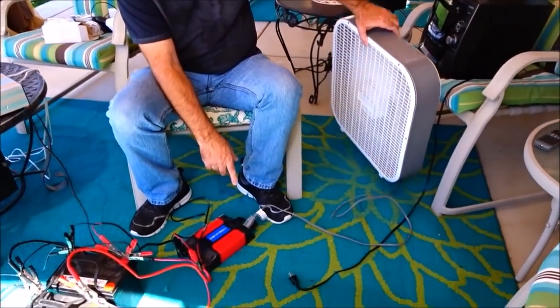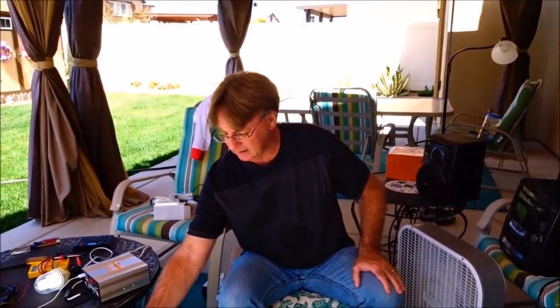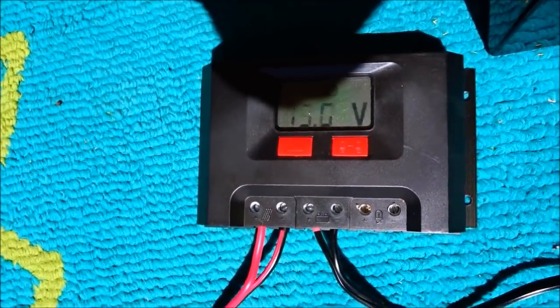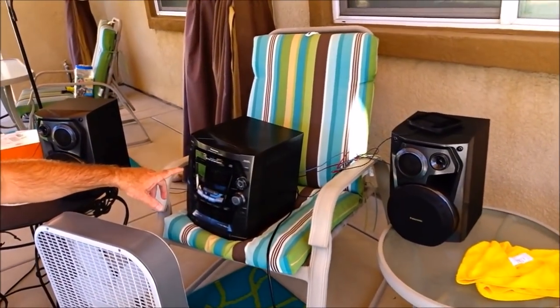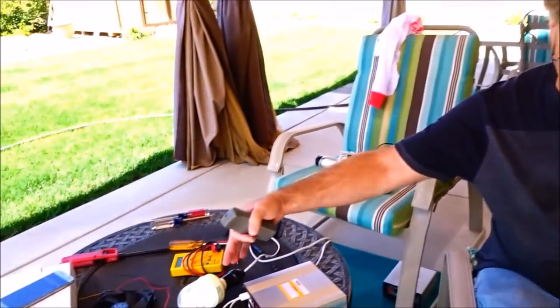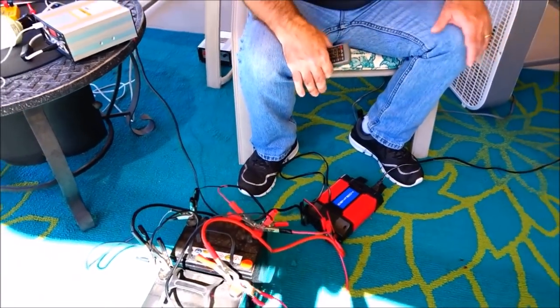Right now I've plugged a regular household fan into the inverter. With the solar on, we're still reading 13 volts, so I wouldn't worry about anything until I saw that voltage come down to about 12.3 — which probably would never happen during the day. Finally in this discussion, I'm going to run this 160-watt stereo system. So to reiterate: we're running 160 watts, we've got a 5-watt light running, the inverter is using some power, and it's charging the phone — so let's say we're using about 180 watts right now.